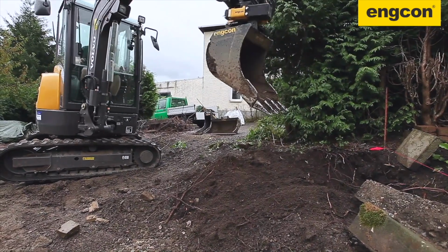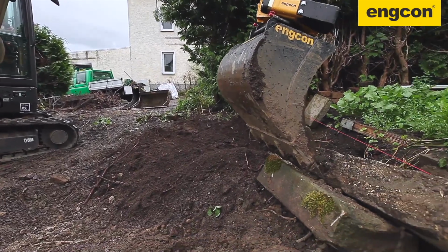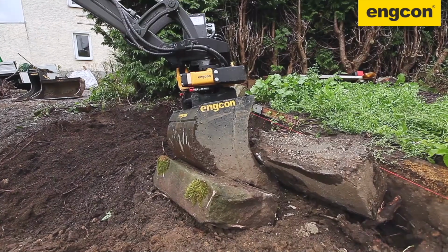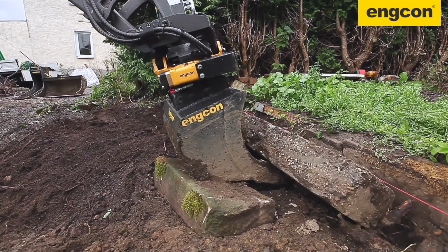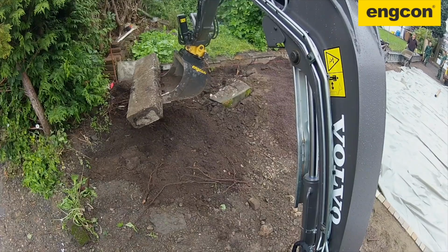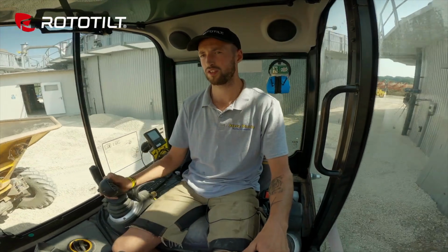Anyway, they're using the excavator for the majority of the work in these situations, but then they also need to have the skid steer around whenever they need to move around pallets of bricks, sod, blocks, or other material that comes up in these landscaping or hardscaping types of jobs. But with a tilt rotator, you can quickly swap into that set of forks, unload and move your pallets around without needing to ever leave the seat of the excavator.